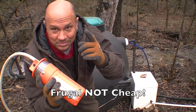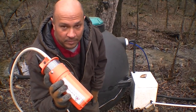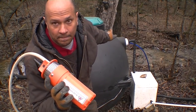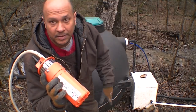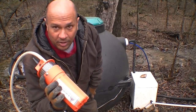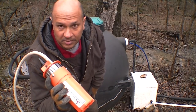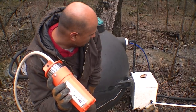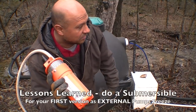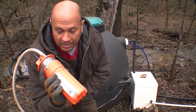That's being frugal, not cheap. With this pump I'm going to be installing it inside the cistern. I've got to drill some holes in the side of the plastic here for the pumping lines going up into the system. I've got to make sure that the PEX goes all the way to and inside the top cap, otherwise it will freeze and expand and crack. All the metal parts in between seem to crack, so I have to eliminate all the metal pieces. I should have run this continual pipe directly into this tank the first time. Let's go ahead and get started.